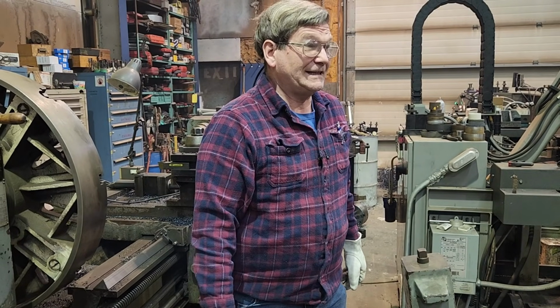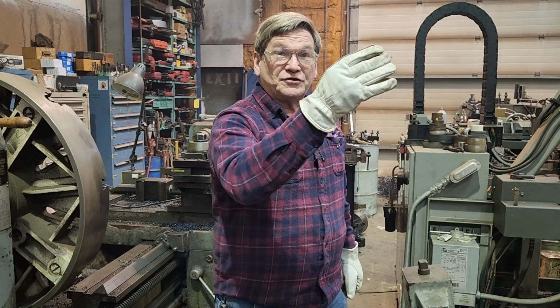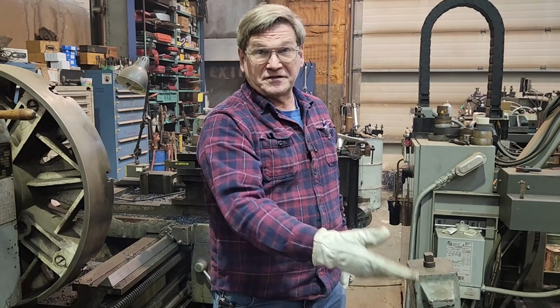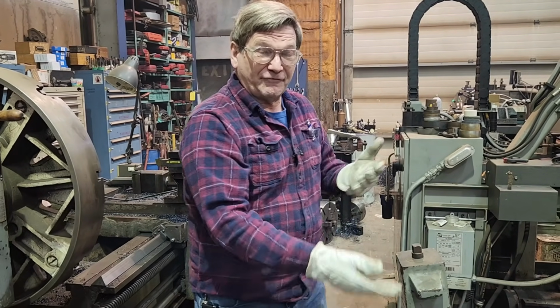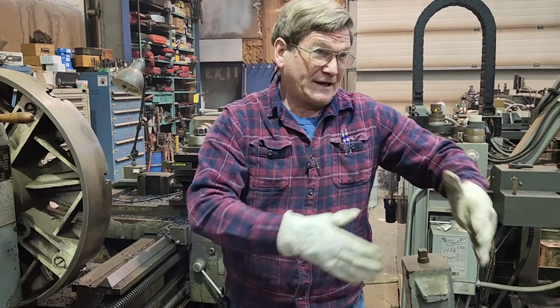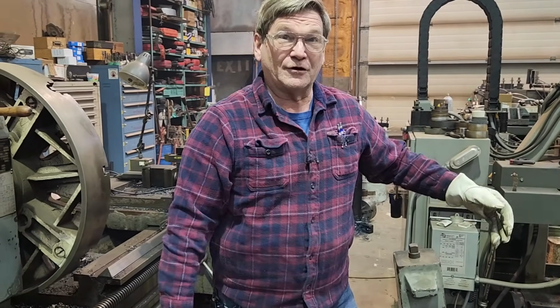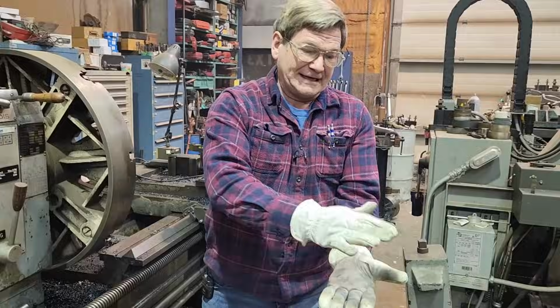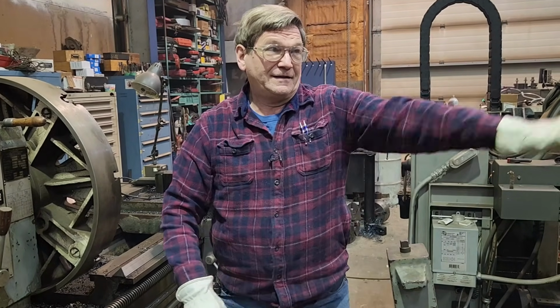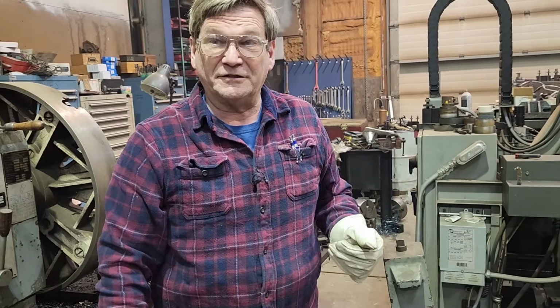And anyway, on that one, I used an air cylinder, actually an air can for a semi-truck that pushed the cutter down. And then it somewhat floated along. The rails guided it for positioning, but it used the air cylinder, had a little cam that was adjustable for depth, and then it would cut the length and the plates would come off. We were removing some welded plates.